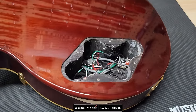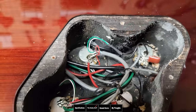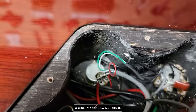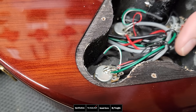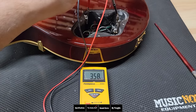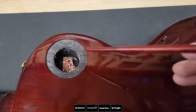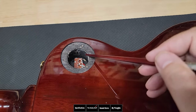Let's look inside the electronics. It's a little messy in there — there's some sawdust, and the CNC routing looks a little rough. The wires don't look horrible, but there's a lot of mess in there — this is what you usually see in really inexpensive guitars. What's interesting is the outside of the guitar does not look like this; this looks a lot worse. They're using really small potentiometers — not alpha pots, they look like they're made in Korea. Nothing looks problematic with the potentiometers, and the soldering work looks very standard for this kind of guitar. The cavity appears to have conductive shielding paint, and the three-way switch is a standard box switch — not my favorite, but what you see in guitars like this.